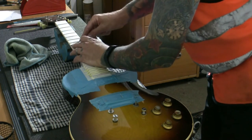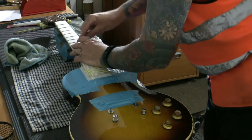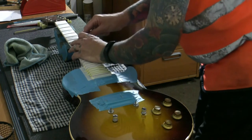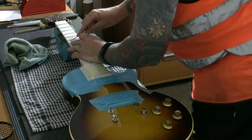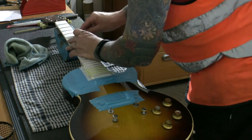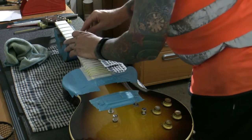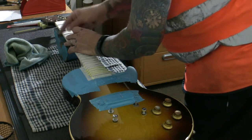So once this is done, that is the frets installed, beveled, levelled, recrowned, rolled over these beveled edges. And we're now ready for the next stage, well, we'll be after I've done this, which will be the polishing. And we'll polish not to bring them just to a shine, but we'll polish to remove all the scratches as well. We know the frets are level because we've not touched the tops.